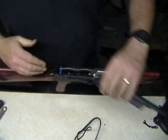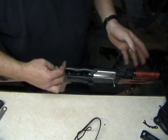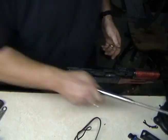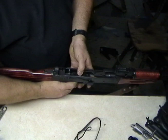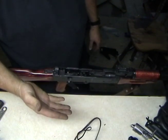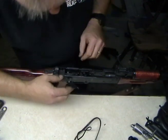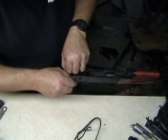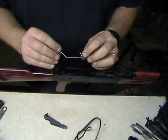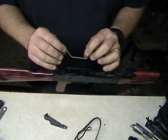The first thing we're going to do is we're going to go ahead and break the top off this thing. Andy, as I understand — correct me if I'm wrong — but I understand that you were cleaning the rifle, meaning you probably had it down to this point here. Hammer forward and you had lifted your safety up, dislodged it more than likely like that. You see this little shepherd hook right here? What has happened is that thing has come unlodged, and I'm going to show you how this thing goes back in.